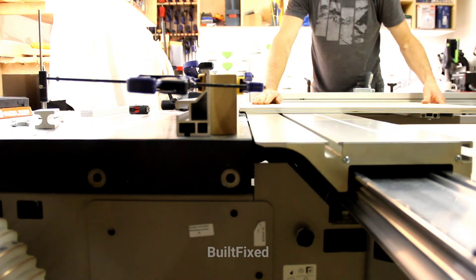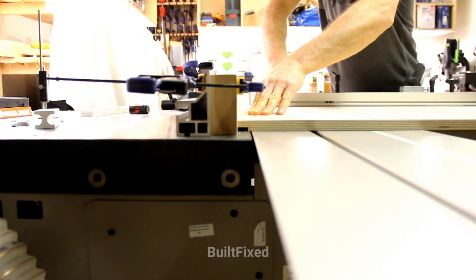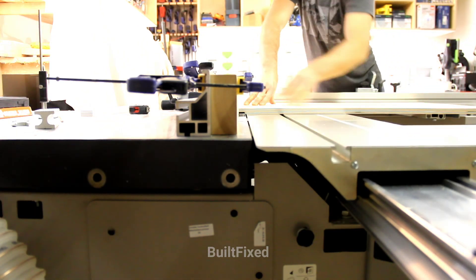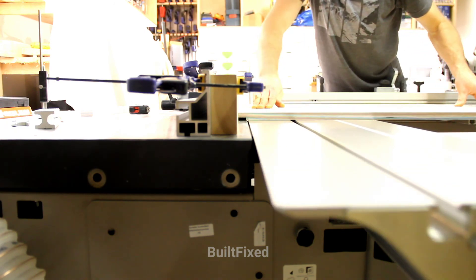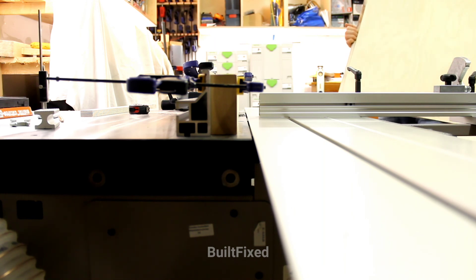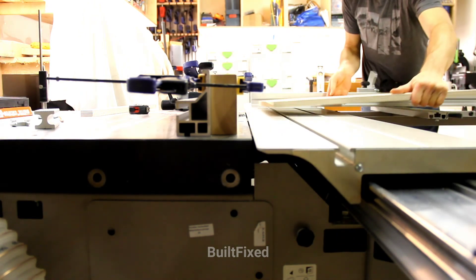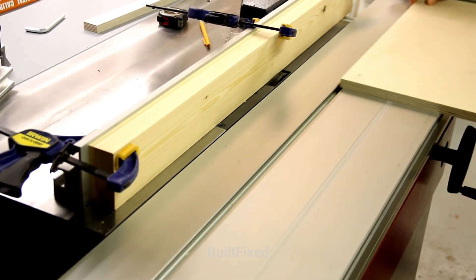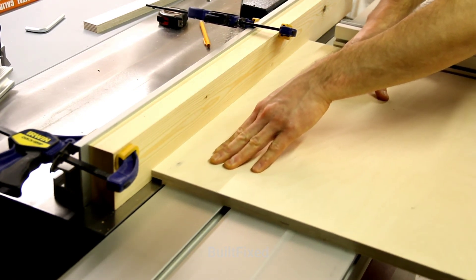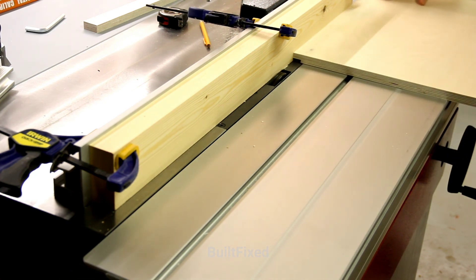You'll notice here I'm going to make more than one pass through, just to be certain that I've actually cut that dado all the way to the same depth. A plywood almost never is totally flat — there's usually some sort of bow or cup in it. It could be really helpful to have some sort of featherboard here to push down and hold that plywood tight on the table. Other methods of cutting a groove or dado could be a handheld router with a track, and that has the advantage that the base of the router is so small that it kind of fits the contour of any bows or cups in the wood better. But I think the table saw is far superior for the speed of the cut and the dust collection.